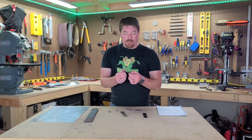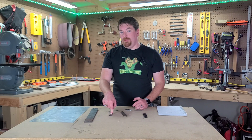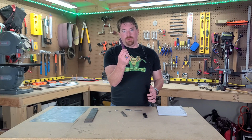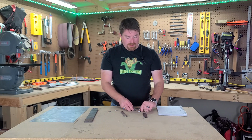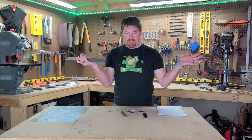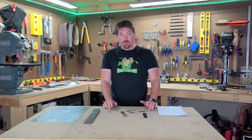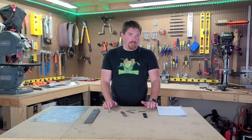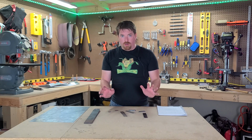I'm really happy that I got through quite a lot of this and I understand what the process looks like, but the heat treat still wasn't of the quality that was needed. So now I know where to go from here, but I also know I was never going to be able to drill through this. Because of snapping the original piece after the heat treat, this was just going to snap again. So from here, now I will be making another section of steel, probably a considerably longer piece, so I can get several blades out of it, and grinding it prior to heat treating it, drilling it prior to heat treating it, then heat treating, then doing some more buffing, polishing, grinding, and whatever else. And also probably cutting it to size prior to heat treat, or getting it as close as I can.